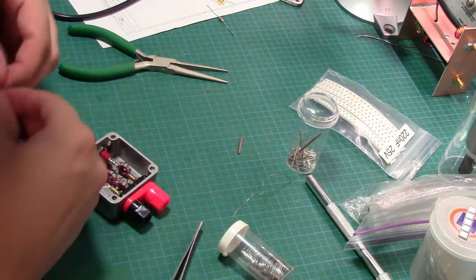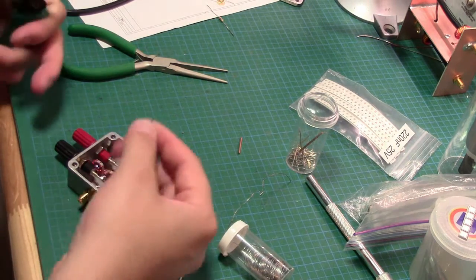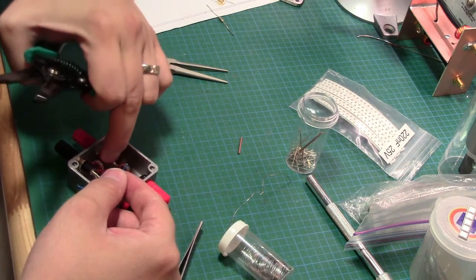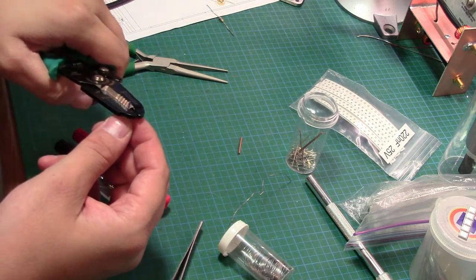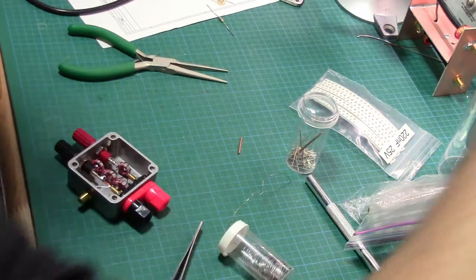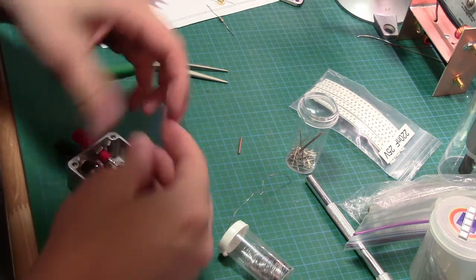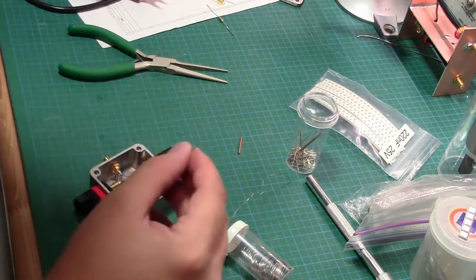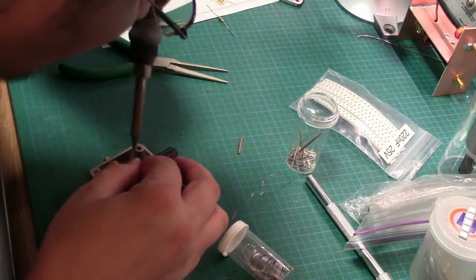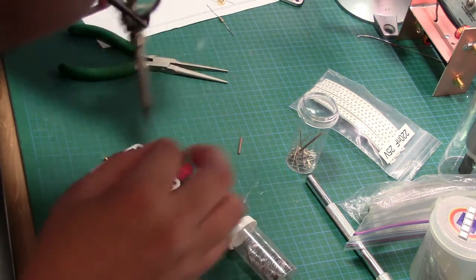Maybe this particular wire, this connection here that goes to, you can't see off camera, but this connection here, which goes from the AC, it couples the DUT side of the input, or I should say the device under test side, and it connects up to the caps and AC couples it into the output here, or the probe output. So, you know, what are you gonna do, right?